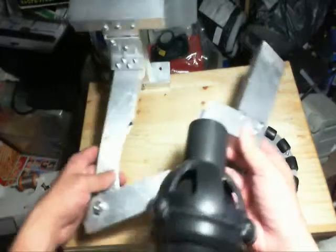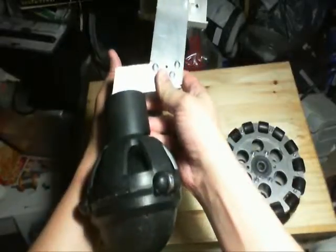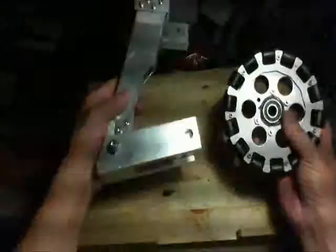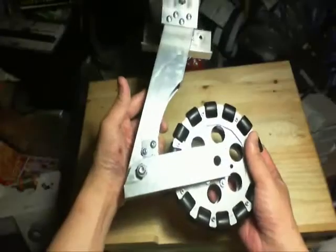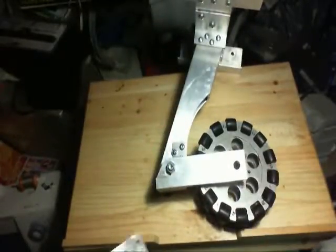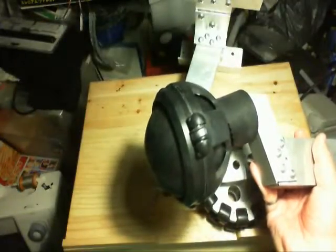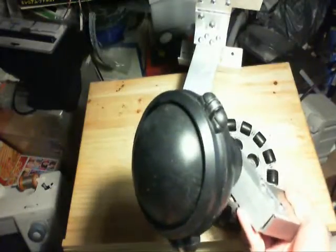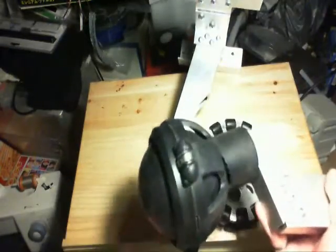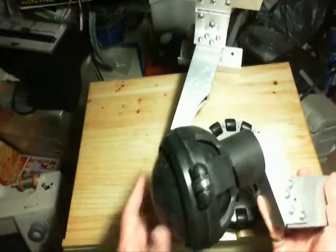This goes up in there and that's where it would sit. With the larger diameter going forward, it should go over cracks better. With the ball caster, I've had no problems going over door sills, elevator sills, cracks, and sidewalks. I know other people have had problems, but I believe that's because their droids are heavier — mine is 110 pounds while others are 225.